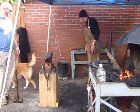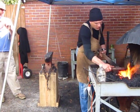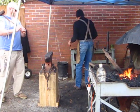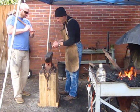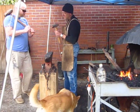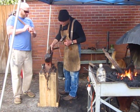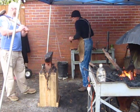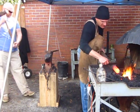I think it's to make the tool, it's to taper your power where you want it. By reducing the surface, you're putting your force into a more central location with a larger mass of steel versus the square, which would displace its heat everywhere. That's probably the real reason. So the smaller area you're hammering with, the more power you've got.